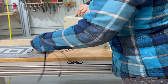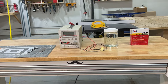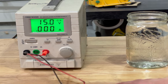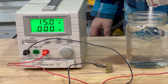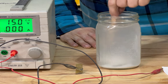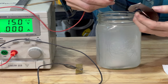After we get the liners sanded and evenly finished, we're going to bring them over here and set up the anodizing so we can turn these a nice coppery goldish color. I don't normally anodize a lot, but sometimes I do it in a more subtle way just to set things off. Where this is an old expensive mammoth tooth, it's more a classier build, so I think the bronze goldish color will set it off. Here I'm adding the TSP, which acts as an electrolyte to transmit the electrical current to help with the anodizing. I added way too much — I hadn't done it in a while. Remember, a little goes a long way with electrolyte; too much and it gets gummy.